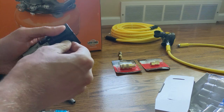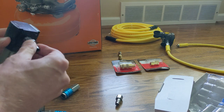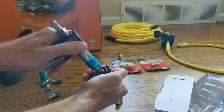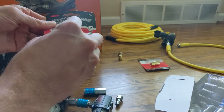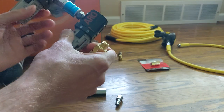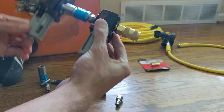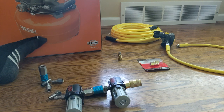Then you take your scuba hookah hose that's in the back of the frame, and you put the adapter end, the barb end, and then you can connect that directly to the regulator. Originally I wanted to use the whip that was on the regulator already, so you'd have something a little more flexible compared to that hard plastic line for the 50-foot breathing tube. I ended up trying to order a brake line fitting to see if that worked. Unfortunately, the inner diameter did not fit the inside diameter of the scuba hookah breathing hose. Wow, I'll say that five times fast. So I ended up connecting that hose directly to the regulator, which seemed to work fine.